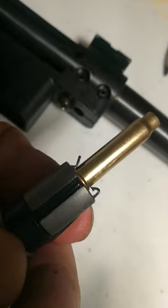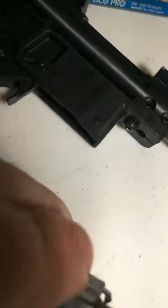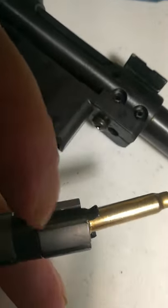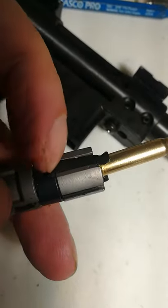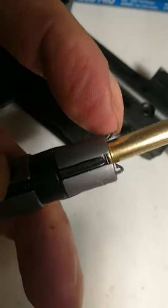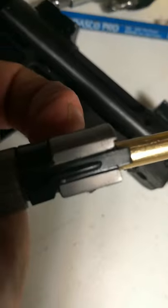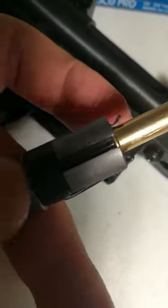Here's your firing pin right here that strikes the cartridge. That's one thing I do for bolt-action rifles — use an empty case to confirm the extractor is holding well. One mistake guys make is removing the shell that holds the extractor. It's under spring tension, and if you take it off too many times to clean it, it loses its tension and springiness. This will open up on you, and the extractor might move in the wrong direction. I wouldn't mess with that shell at all.